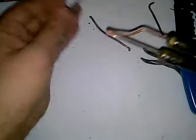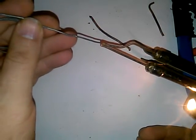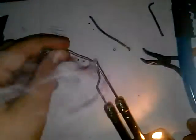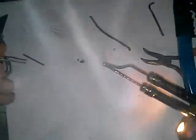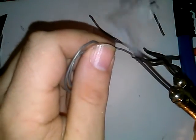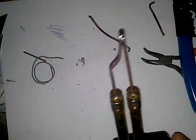Plug this in. Now we're plugged in. First thing you want to do is tin the tip — let it heat up good, let it smoke. Apply some rosin core solder to the tip, let it cook down in there and get in it good. Clean the tip up good — be generous, don't be shy. That's if you're a poor man like me, you do things like this.